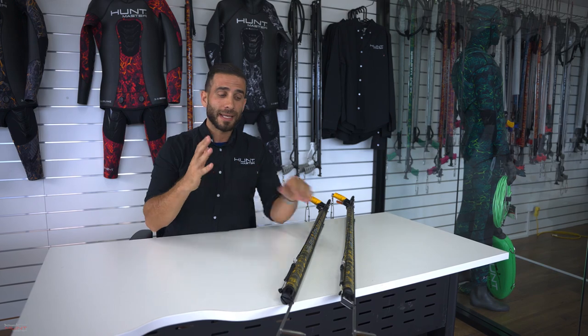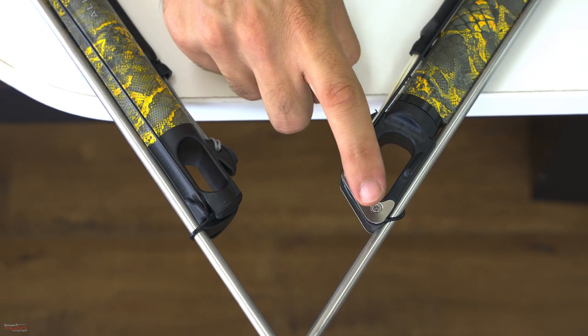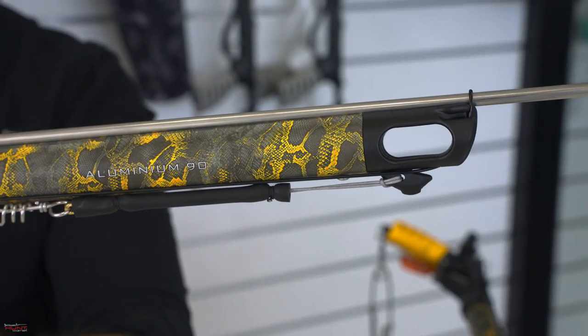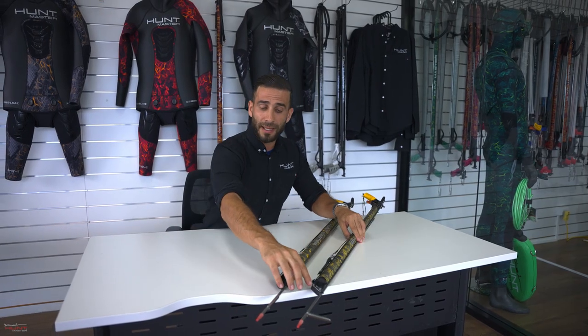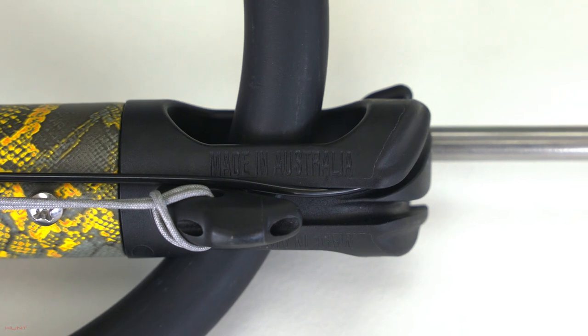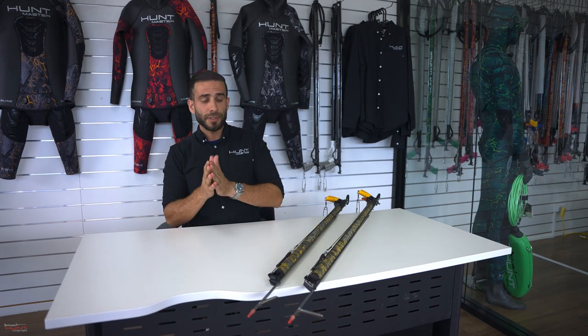The first major difference is that the old design had integrated stainless steel guides. We've moved away from that by making this head one carbon plastic piece — one of the strongest plastics in the market. On the old heads we were drilling into them, but we want to avoid drilling into this new head so that we can increase its durability.